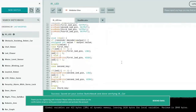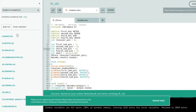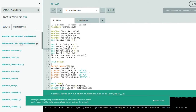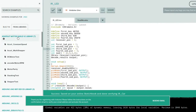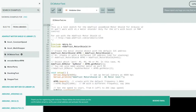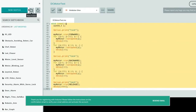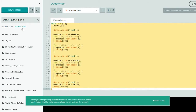Let's see how we can program this. Go to Examples in the Arduino IDE, then from Libraries find the motor shield library, press it, and you'll see all the examples. Go to DC Motor Test, then copy and paste it into your sketchbook so you can make changes.